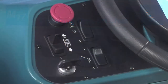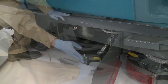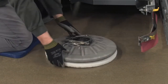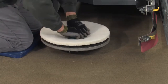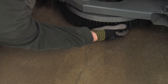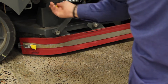Changing disc brushes. With the machine stopped on a level surface, turn off the machine and set the parking brake. Open the brush compartment door. Unlatch the squeegee assembly and swing the assembly outward. Turn the brush until you can see the brush spring clip, press the spring clip together with your thumb and index finger, and the brush will drop off the brush drive hub. When using pads, attach the pad to the pad driver and secure the pad with the center lock before installing the pad driver on the machine. To install the pad driver or brush, align it with the motor hub and hook the spring clip on one of the hub points. Press down on the brush and it will snap into place on the brush hub. Confirm the brush is securely installed, close the squeegee assembly, secure the latch, and close the brush compartment door.